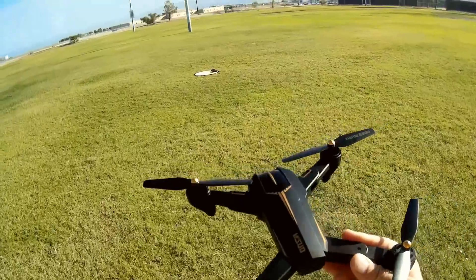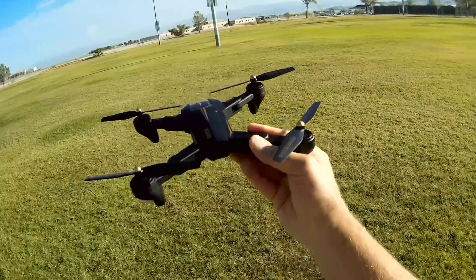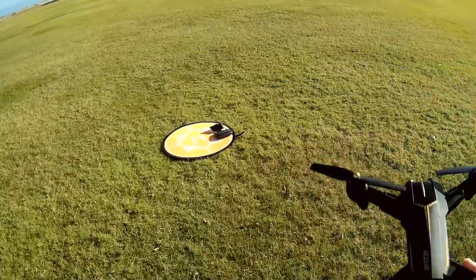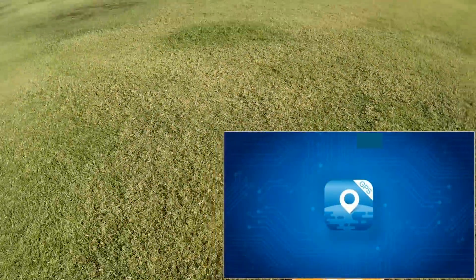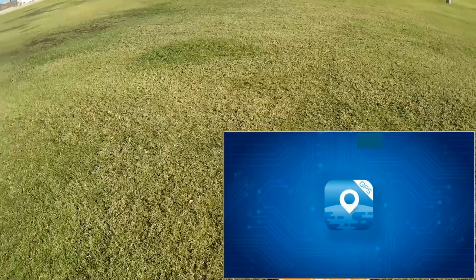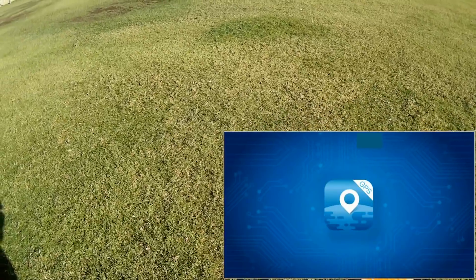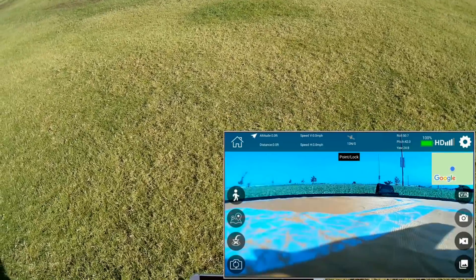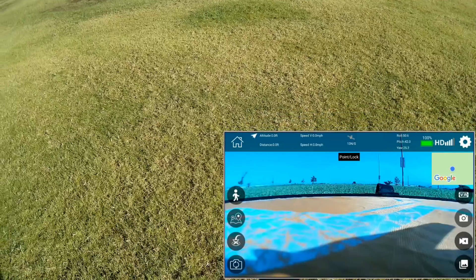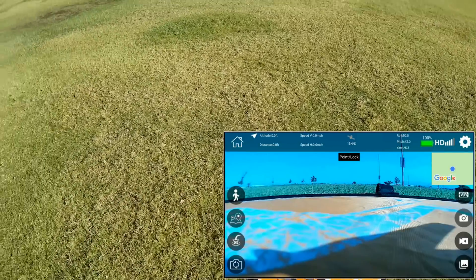That avoids or lessens the chance for toilet bowl effect, which can get worse as you attempt to fly with TBE. Toilet bowl effect is where the drone circles around like it's going down a toilet — it just gets progressively worse until you crash. This is the XSWGPS app, available on Google Play and iTunes. Click that center button that says GPS to open the app — we've got FPV signal and sufficient satellites to fly, with 13 satellites, indicating GPS GLONASS on this system.